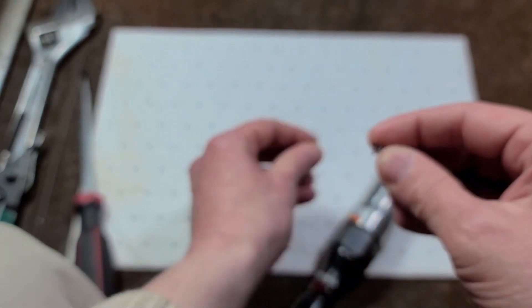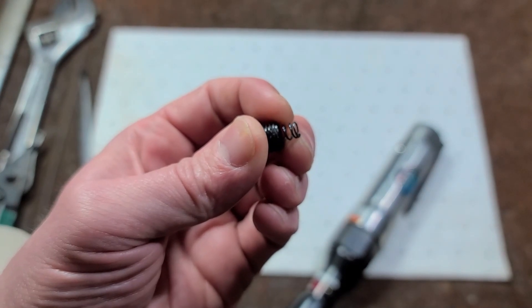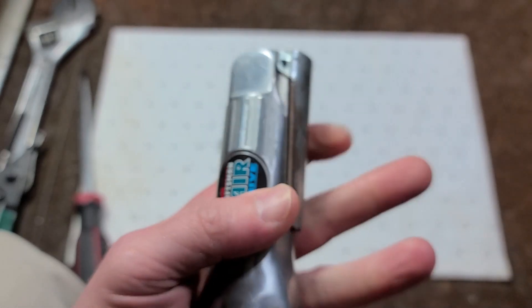This post here just presses up on the bottom of the valve, and the spring is what helps return it. So what ends up happening is you have the spring up here — it presses on a ball bearing, and then this is pressing on the other side, which is actuated by the lever.